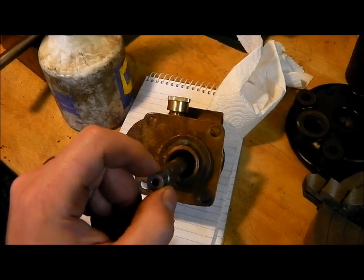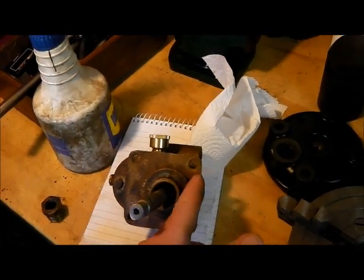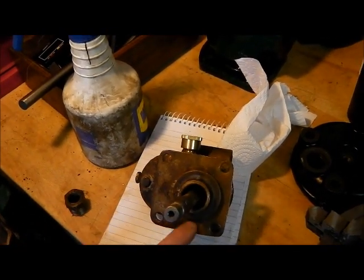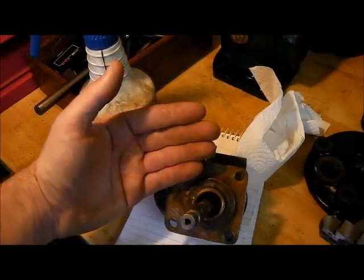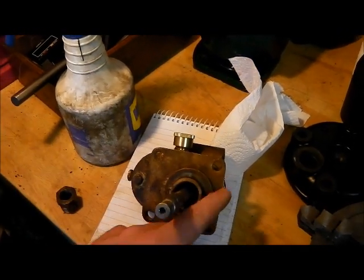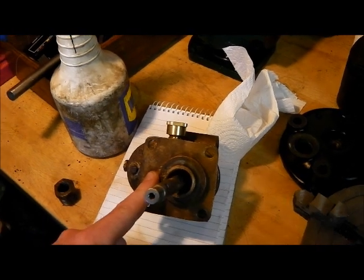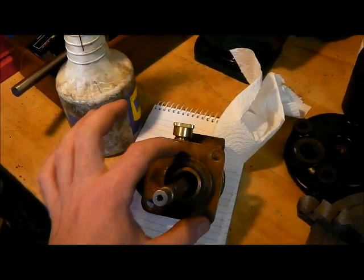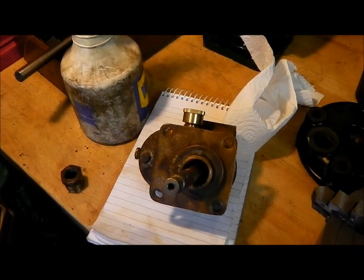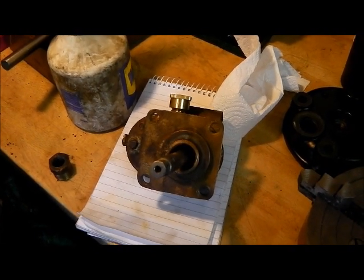You can see that's pretty bad. When this was made that would have been bored concentric to this bit here — I reckon those machining operations were done at the same time. Once cleaned up this surface will be true to the body of the pump, which it measures up to. What I can do is make a little plug to go in the chuck of the lathe to carry this, or I might be able to hold it directly in the lathe chuck — though there's not very much of it. If I can get it adequately supported it should be easy enough to turn it, bore it, and press in a top hat spacer.